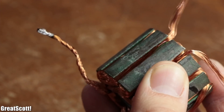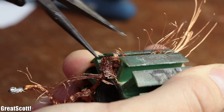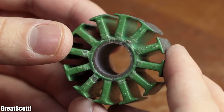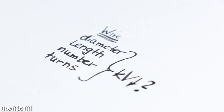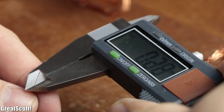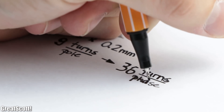For now, let's unwind the coil wires from the stator. The first phase was not that hard to do, but the second and third phase were a complete nightmare to unwind due to the tons of adhesive the manufacturer used to keep the windings in place. After an hour of applying brute force, I got my mostly undamaged naked stator core. By having a closer look at the coil wires of one motor phase, I counted a total of 26 individual enameled copper wires with a diameter of 0.2 mm each, and while unwinding I counted a total of 9 turns per pole — so 36 turns per phase.